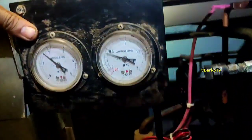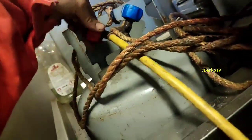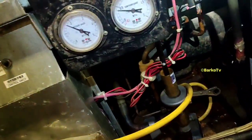Almost 18 — 17 bars. Okay, that's enough. Turn off this valve, the liquid valve. Then turn off this valve to let the low pressure switch activate, and that's it — finish charging. Secure all valves.